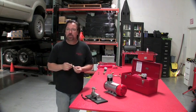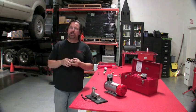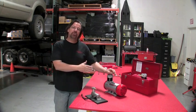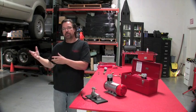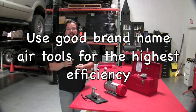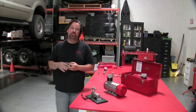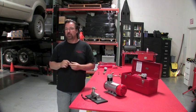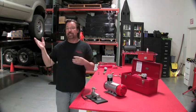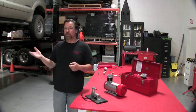One of the things we find is a lot of customers will call and say they can't get one lug nut off with their impact gun, and I'll ask how much air they have in the tank. They say it's at 125 PSI. Is there something wrong with the compressor? The compressor's not even running — all the energy's coming from the tank. So if the tank with 125 PSI isn't getting the lug nut off, it's not the compressor because it's not even running. The stored energy in the tank is running the tool.